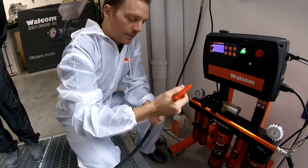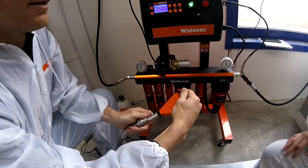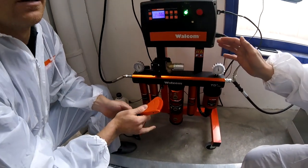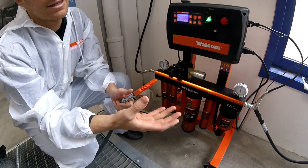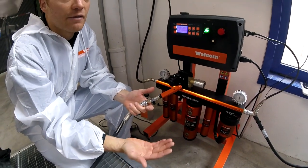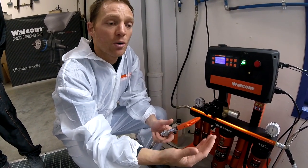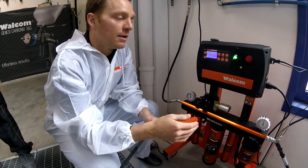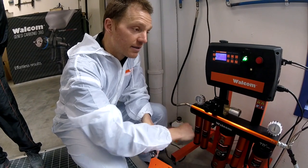Why is it important to have the proper temperature? For example, with this blower — if you put your hand right here you're going to feel that the temperature is hot, but if you go down here you feel it cold. This is a physical process: air expansion. Whenever you have air expansion, the temperature drops around 10 Celsius. It means that on a typical winter day or a humid day, your compressor air is going to be in the 10–20 Celsius range, and by the time you have expansion and the drop, it takes the temperature so low that the paint doesn't flow properly. You don't have a nice smooth finish — you're going to have more orange peel. So the TD3 makes this parameter constant during the entire year and always gives you better conditions in terms of relative humidity and proper temperature for the silica gel.